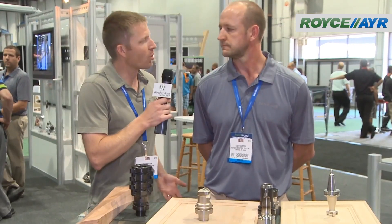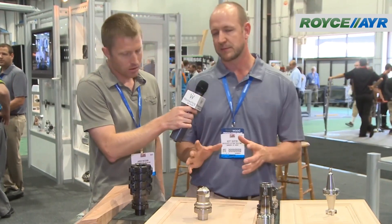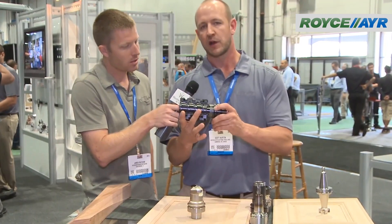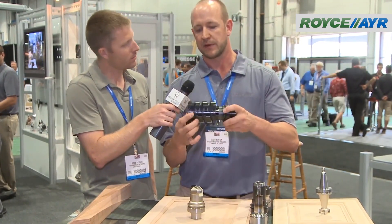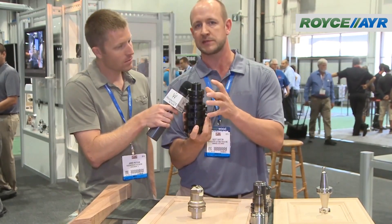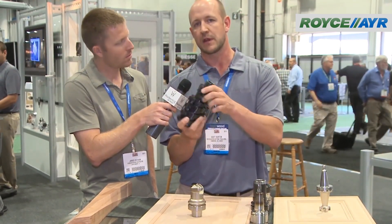So what types of tools are best suited to the integrated tool holder? This type of system is designed for larger, heavier tool bodies, though smaller tooling can also be used. The focus is on large hogging tools like this, designed for cutting deep depths of cut. It's a big advantage to have this tool built in one piece because, as we said, it's rigid and balanced.